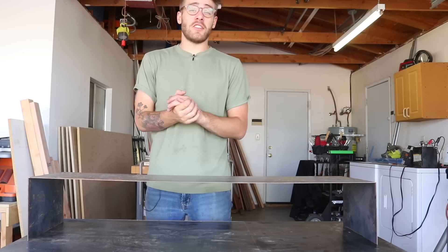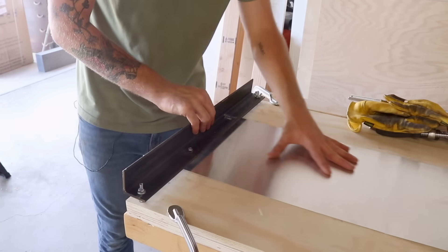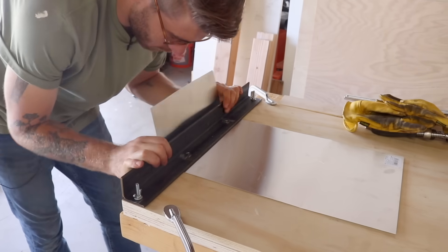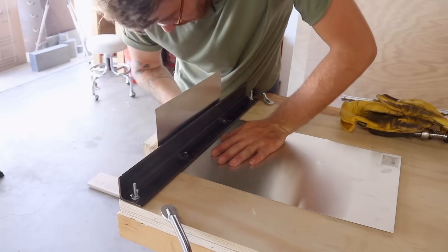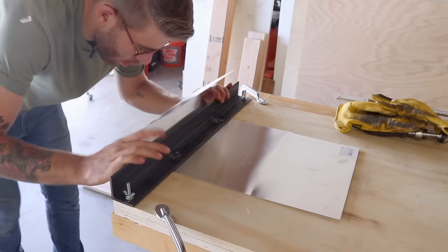What's really awesome about this jig is you don't always have to cut grooves. If you're using thinner metal, like this piece of sheet metal, you can clamp it down and bend it without any help. Although I did find that if I used one of my wooden handles to press the metal against the brake, it got a lot cleaner of a bend.